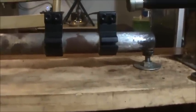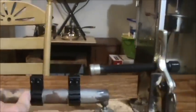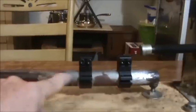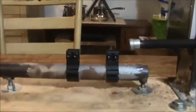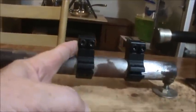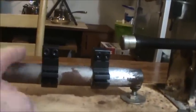If you're going to use your spring compressor on a number of rifles with both dovetail and Weaver mounts, I'd recommend making two of these pipes. Either get a solid one-inch bar stock that is one inch in diameter, or if you take a one-inch pipe which might be a little over, you may want to run it across a lathe and cut it down to one inch so your scope rings will fit on much better. These are medium-tall heavy-duty dovetails.